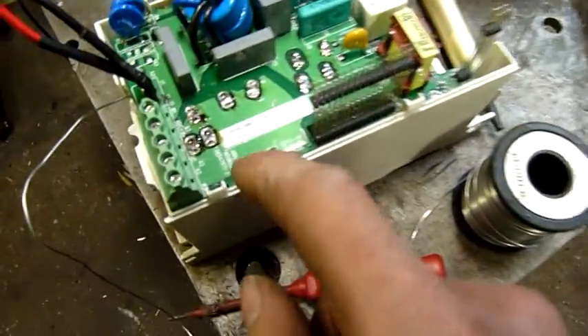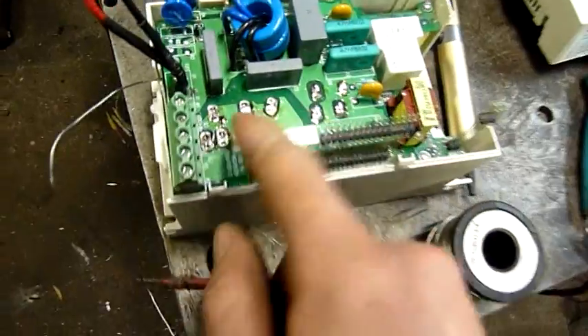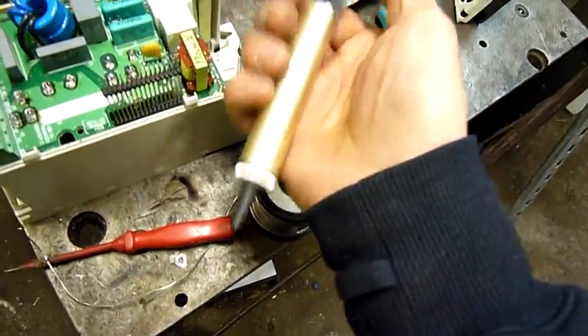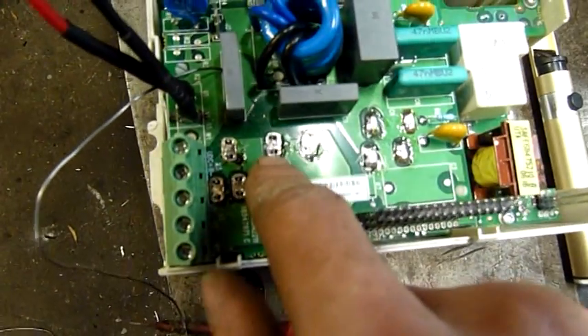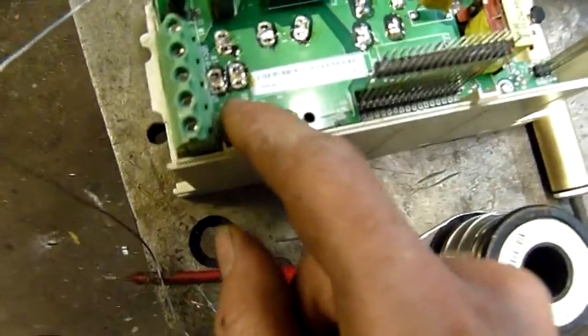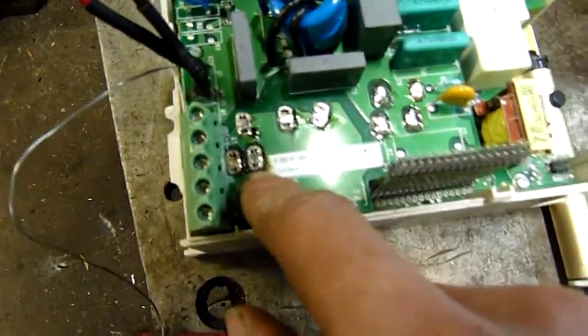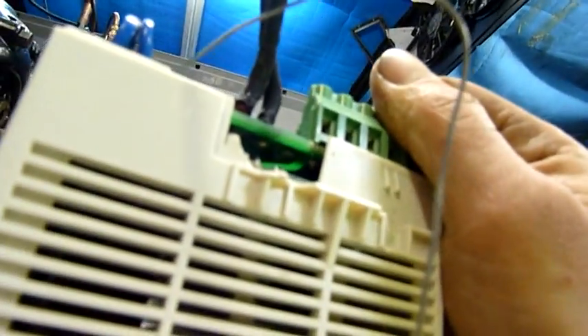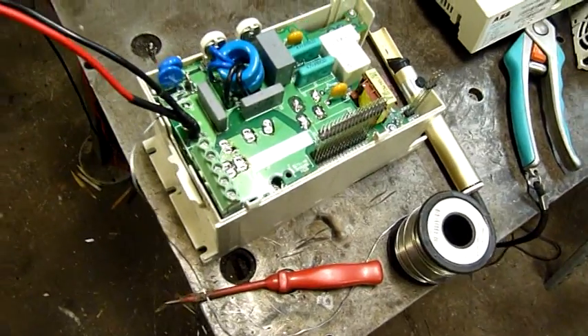I want to remove that and investigate. Everything on here is hardwired through header pins — both sides are soldered together. So I'm carefully and gradually desoldering them. It's not an easy task, but just tin it, pump it — just using your regular spring-loaded solder sucker. Got to be careful not to pull traces off the other side of the board. Looking underneath with a good light, I can't see any traces going to them apart from the main one on top, so they could just be supports — but safer to treat them all very carefully.